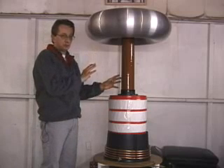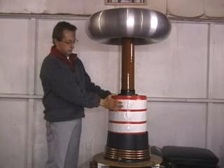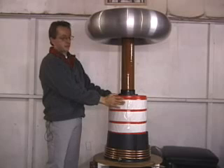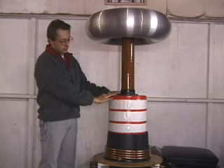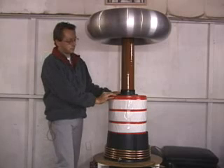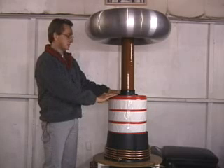There were no primary inputs for this portion of it. For the driver coil and the primary coil, I went ahead and modeled those as cylinder objects and gave a ground connection on both of them. The driver coil here is 12.75 inches in diameter, 18 gauge, close wound. At this point the whole coil was wound when I started modeling.